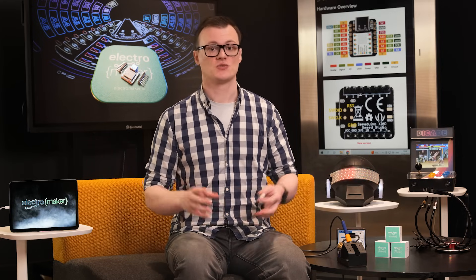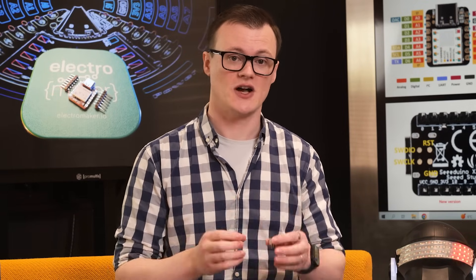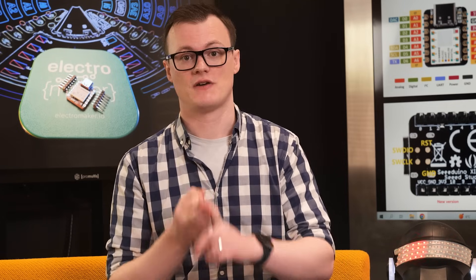Finally, any project that just wants to reduce the size of its Arduino board can massively benefit from these XIAO boards. Arduinos are fun, but many are rather large, and this isn't always great — especially if a project needs to be shrunk in size for neatness. Of course, the XIAO board has fewer GPIO connectors, but this is a worthwhile sacrifice. The XIAO range of boards are excellent for both makers and professionals alike thanks to their compatibility with the Arduino programming environment and MicroPython, their compatibility with SMD technologies, and their use of commercial-grade processors such as the SAMD21G18 and the NRF52840.